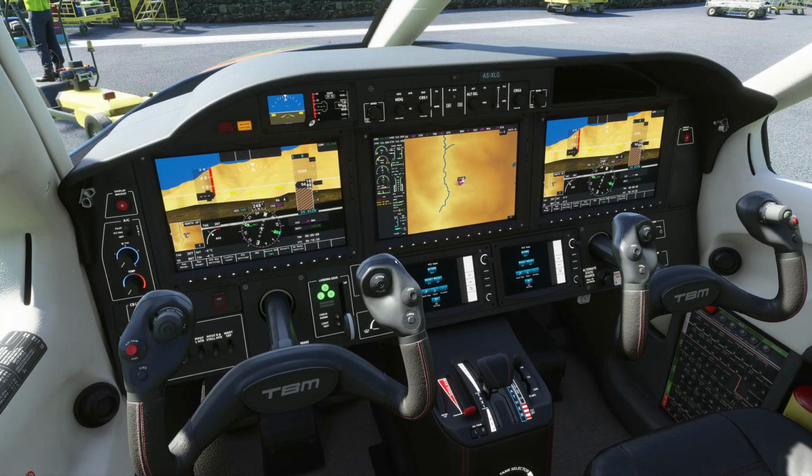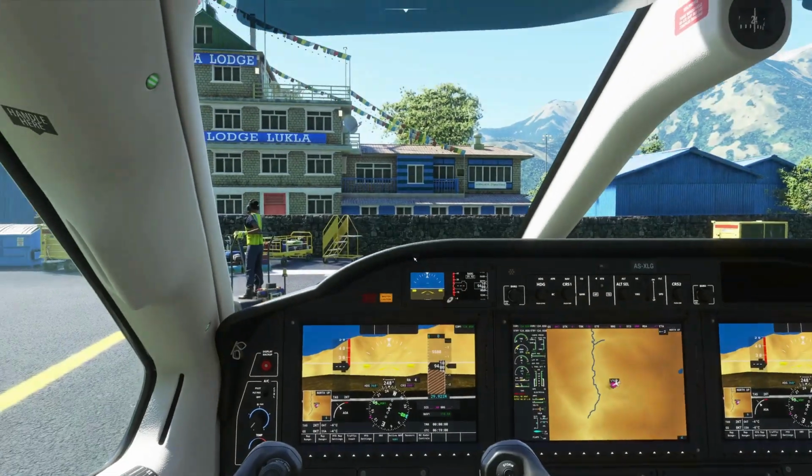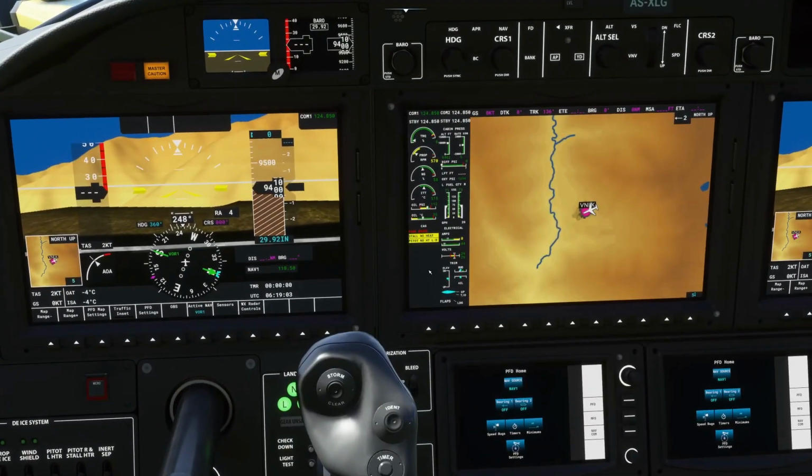So we can see that everything's running quite normally. Right, so that is it, and the gauges actually will stay as they are. You can see the oil temperature now is 35, so that will probably stay as it is. Just looking at the battery amps here, below 50, and it's reading out 44, and as we said the voltage is 29. Okay, and fuel is there. So now we can move on to shutdown procedures.